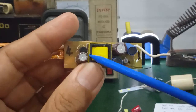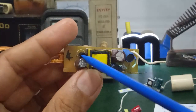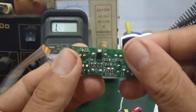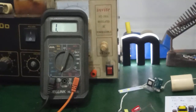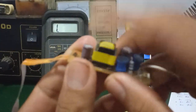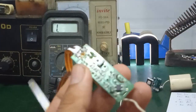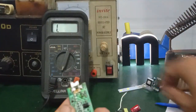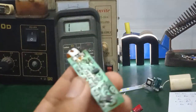To test the LED driver board of the Philips LED tube, based on its structure, the most common failure is the 13003 transistor. You just need to test it — measure it hot and cold — to determine whether the driver board is working properly or not. The flyback transformer can also fail but it's very rare; usually it's just a broken lead wire.